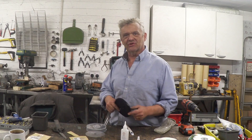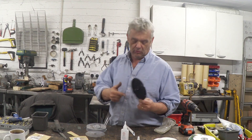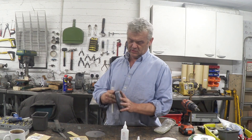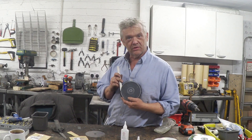While we wait for that to dry, I've taken the actual case and the central spindle, drilled it out with some 5mm holes all the way around. Then I've taken a bit of 15mm pipe and cut it so that it makes a tangent to the circle. Now we're going to hot glue that on.